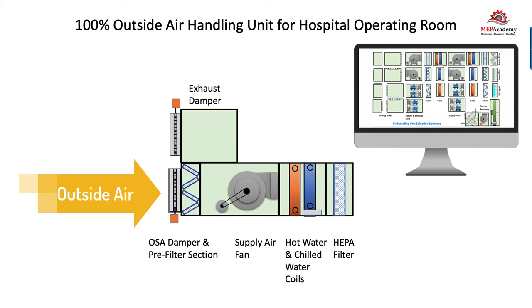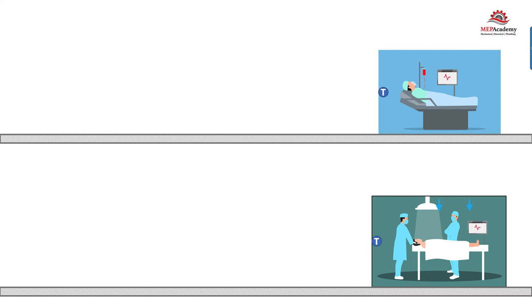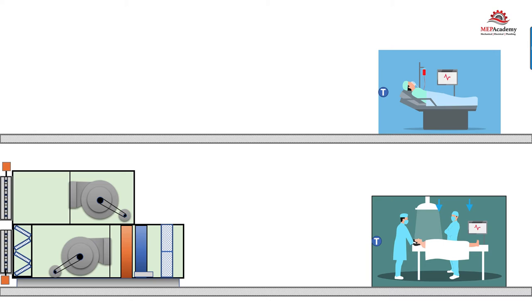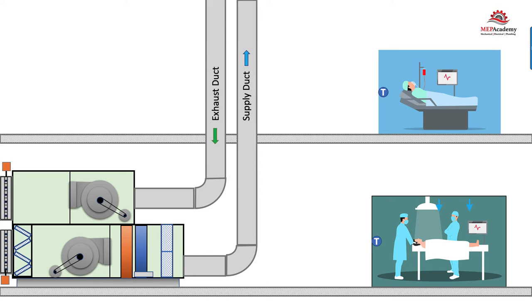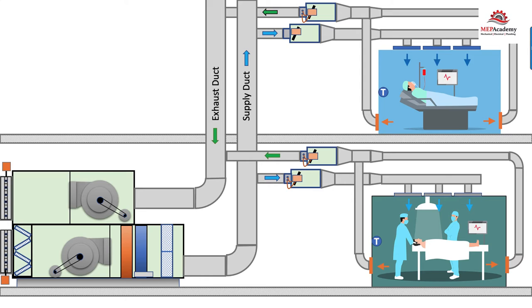On the exhaust side, we need an exhaust damper and an exhaust fan to take the air from the room and exhaust it out. Now we'll take that air handler we've built and put it in the actual room. The contractor will set it into the mechanical room in the hospital. We have our two operating rooms, and the contractor will run the main ducts — the exhaust and supply mains. From there, they'll tie in the branches through exhaust and supply valves, feeding the operating room with laminar flow grills and low return. The second operating room has the same exhaust and supply valves, same high ceiling supply, with laminar flow across and down over the body to keep germs down and out low, exhausting low.